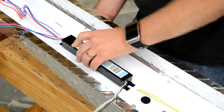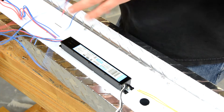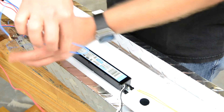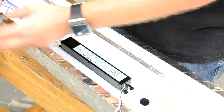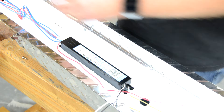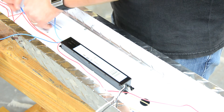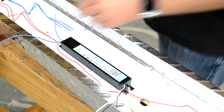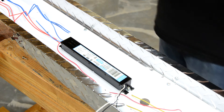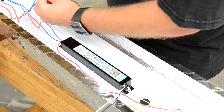Here's my replacement ballast. I'm going to go ahead and attach it with the mounting screws. I've got more than enough wire here to make all the connections, so I'm actually going to cut some of them short. But before I cut them short, I want to wrap them where they're going to go so I don't cut them too short. The next thing I need to do is strip these wires so they can accept wire nuts — you want to take off about three-quarters of an inch.